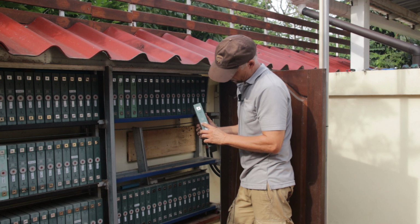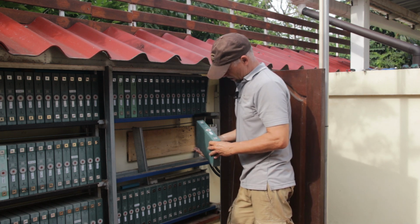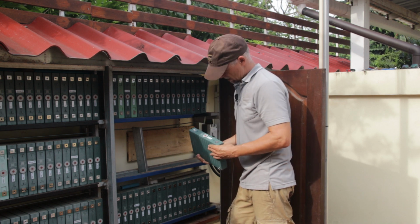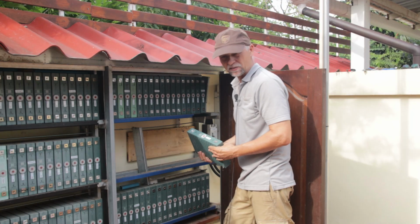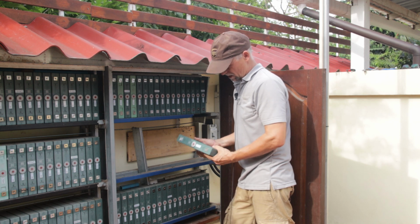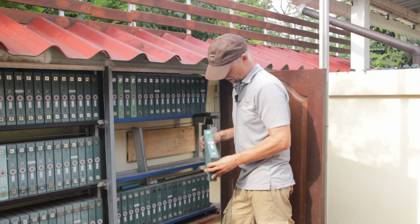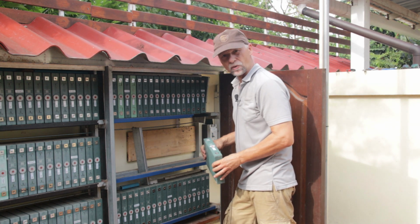They do come with an active vent here, and the moment I got them, you could always smell electrolyte, right? So when you can smell electrolyte, it also means that the electrolyte is evaporating. It must disappear after a long time. So after many years in operation, I guess that this kind of cells are slowly drying out internally, and that is then causing the internal resistance to rise and the capacity to drop.